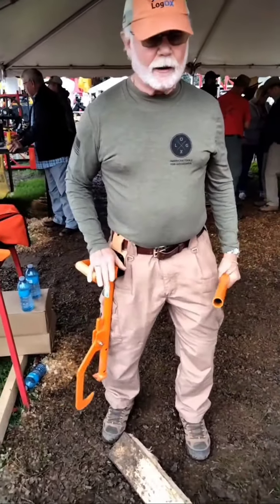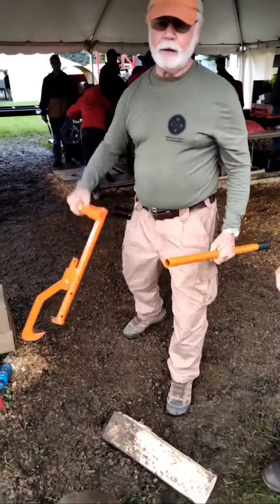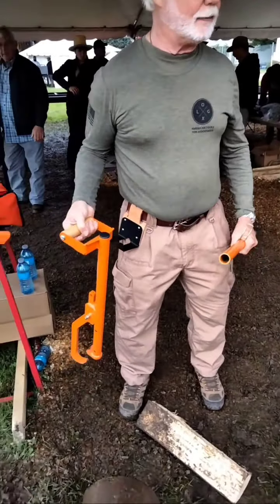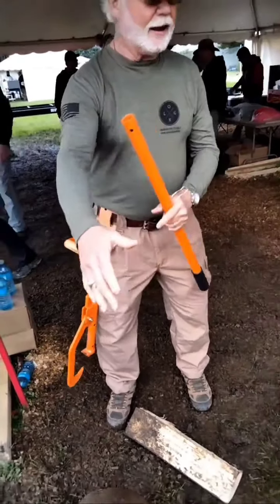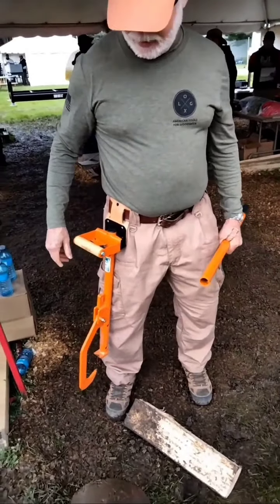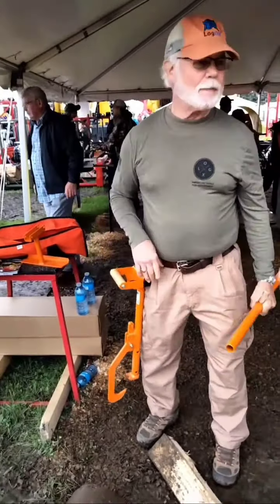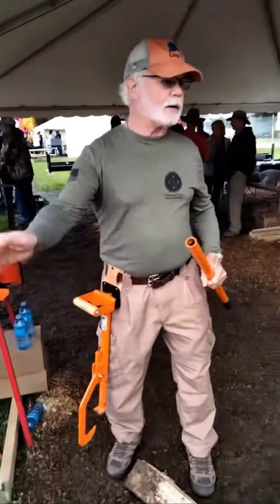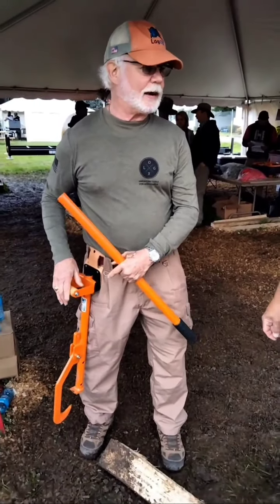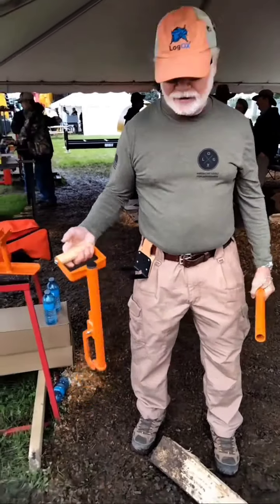One of the great things about this is it's a great tool for feeding the splitter — you grab a log round, lift it up onto the splitter, drop it there and do your splitting. It's not recommended to put the handle with the extension while it's in the holster. It's really not designed for walking around the woods with it on the side — it's designed so that when you're doing splitting you have a place to set it down rather than throwing it on the ground.